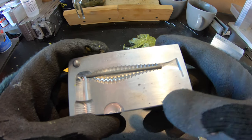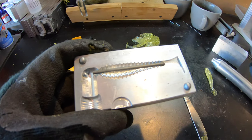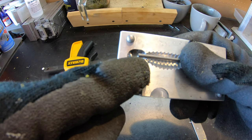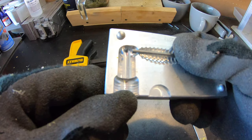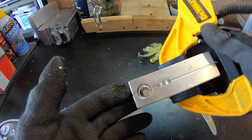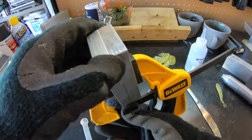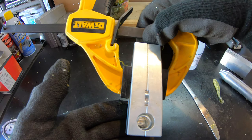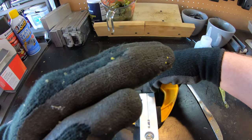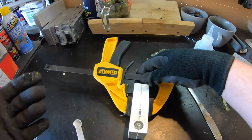We're going to go back to the drawing board. What we have right here is a different metal steel rod that you can buy at Home Depot as well. This is eighth inch thick — it's not going to slide back and forth or move around inside of the mold as much. One issue might be that the spout right here is not going to be open enough for a complete pour, so that's something we'll have to figure out as we go. With those last rods I wanted everything forward, but this time I'm going to do the opposite — lean it all the way back so that rod goes all the way to the back of the swim bait and won't move around. I'm hoping that thicker rod is going to stay put because the smaller ones lifted up inside the bait, making the rod not straight and messing up my core.